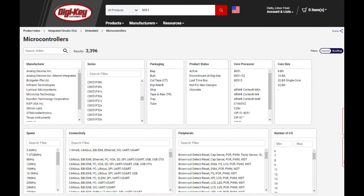I searched for 8051 on DigiKey and there are 3,400 different microcontroller chips — many with built-in LCD or LED drivers, and part numbers often containing '80', '89', or '51'. But the problem is you're really stuck with 8-bit. The moment you need floating point, you have to simulate it since they often don't have an FPU. For any larger integers, your flash memory starts ballooning because you're doing 32-bit math on an 8-bit micro. Sometimes they have DMA or nice peripherals, but I2S would be a challenge.